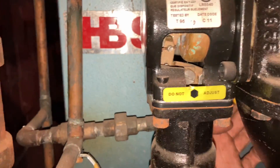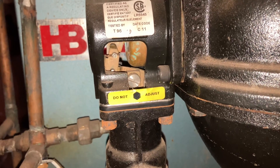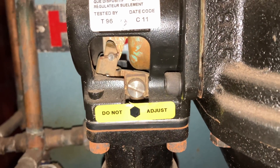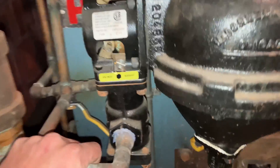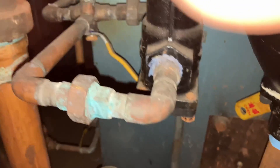We're flushing — water level is dropping but we are not feeding. If you can see our linkage, it is moving but no water is feeding in. Most likely our strainer is clogged, so we'll take a half inch socket and loosen up on this.